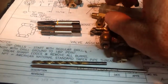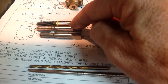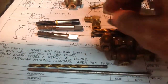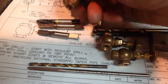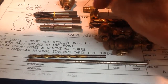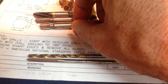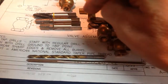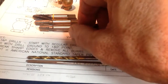Another important thing to note is tapping for the 1/16th-inch pipe thread. First I used a conventional 1/16th-inch pipe tap, then I used this fancy short projection one I got from McMaster-Carr. It's supposed to give you wider holes for a short projection, and as you can see, the holes tapped for the 1/16th-inch pipe are very short, so you don't have a lot to play with. Long story short, even after using both of these, I couldn't fit a conventional 1/16th-inch pipe thread from these fittings. So I actually took another one, ground off the first 5 or 6 threads — I did that by trial and error, grinding off 2 or 3, re-tapping one of the valve bodies, test fitting it, and grinding off a little more until I got what I needed.